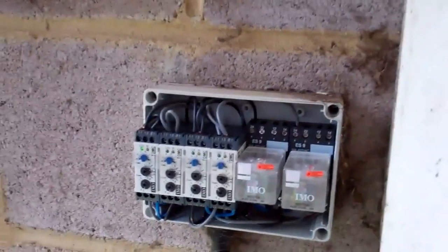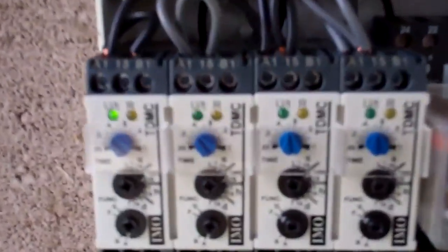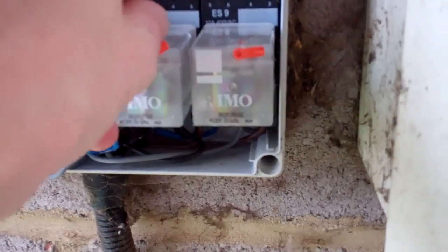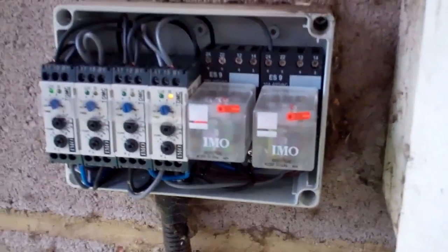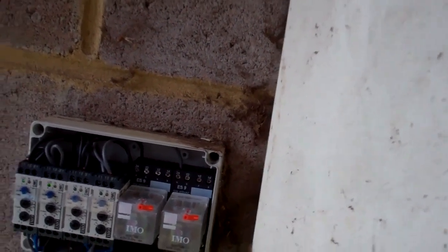The two compressors have to have a staggered start as they're on pump down. There's a delayed timer in this box — whichever one decides to start first holds the other one off for six minutes. That's the two timers working there, two lights flashing, one for each unit. We've got some relays there, and if the timers go wrong you can override it. It's working there very high.